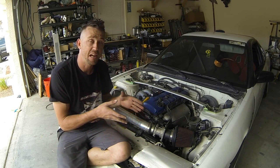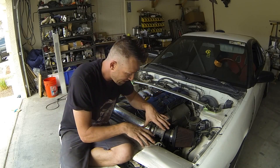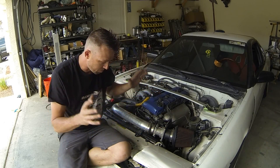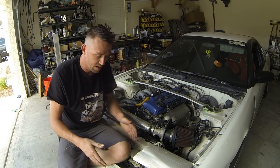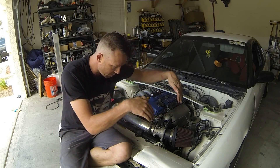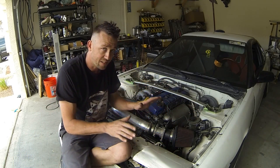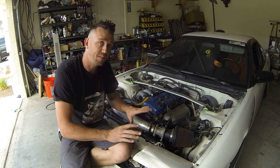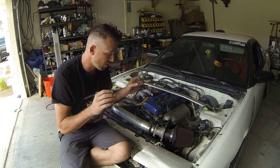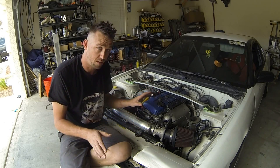So look very carefully at the damage and really assess it. I'm checking everything out on this one. Before it rolled into the shop, I took my usual visual assessment — the crash beams, the bumper brackets, the actual chassis rails themselves. The main rails are down low while the damage and the impact was up top here. That means I likely don't have a crooked chassis. Even if it is, it's very, very minor. I see absolutely no deformation or damage to the main rails, so this chassis should be good to go.